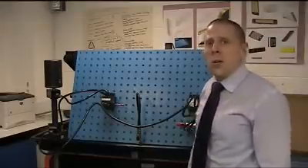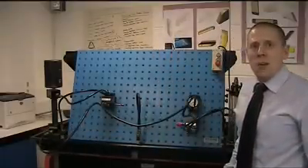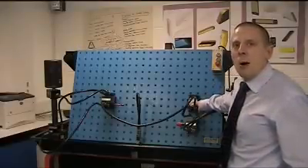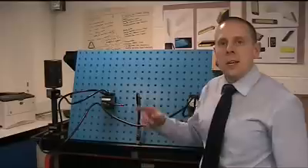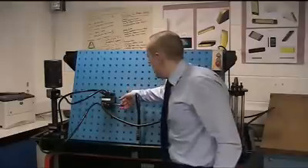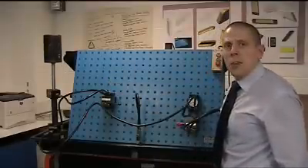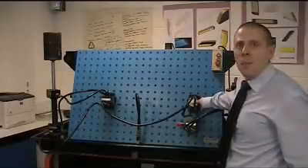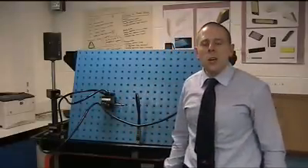In the first position, all we're doing is diverting oil from this line directly back into the tank. We know that we're relieving pressure on the valve because our pressure gauge is showing a pressure very close to zero bar. When we engage one of the other two positions, we expect to see the pressure increase. Moving the valve to the other position, the double acting cylinder extends and our pressure has increased to roughly 10 bar. Moving back to the central position, the pressure drops as we circulate oil back to the tank.